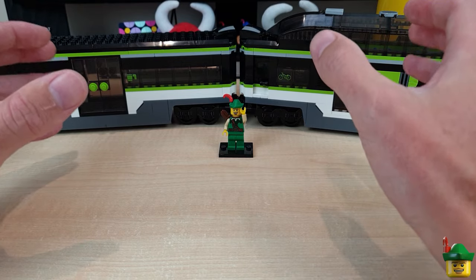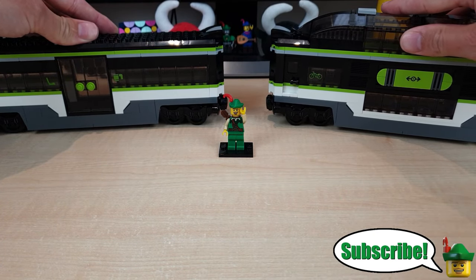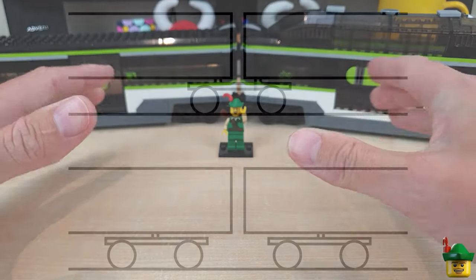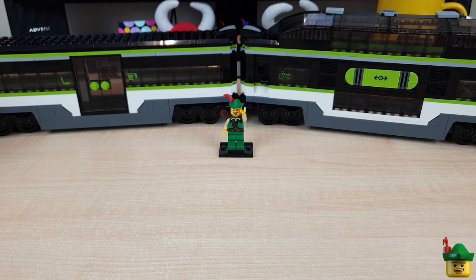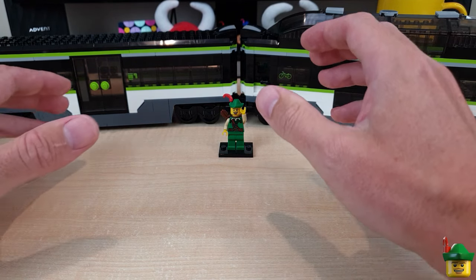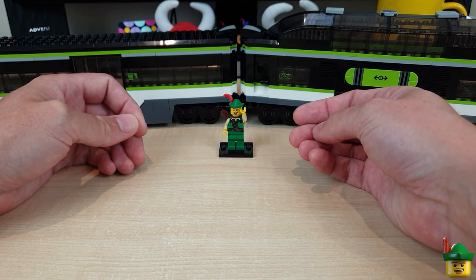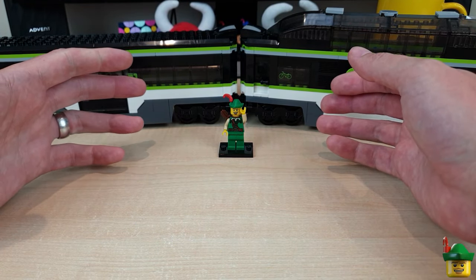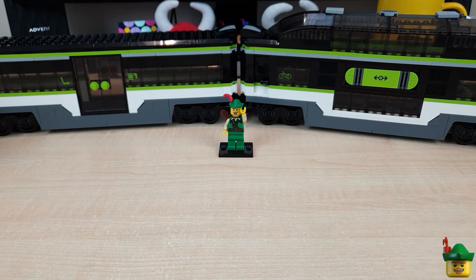So what are Jacob's Bogies and why do we need them? Instead of having a separate bogie on the end of each railway carriage with buffers and a join between them, we have one shared bogie that spreads the weight between two carriages, smoothing out the ride without the extra weight and drag. They were invented by German railway engineer Wilhelm Jacobs. Benefits include improved safety — nothing can come uncoupled in a derailment — lower weight, simpler and cheaper construction, and less noise from fewer wheels. The downside is they require a workshop to separate, as it's a semi-permanent coupling, and each bogie bears a greater load. But that's no problem for an express train like this.